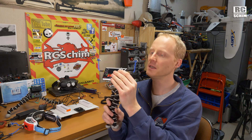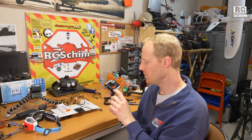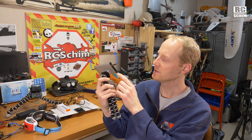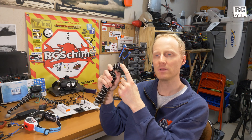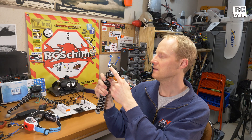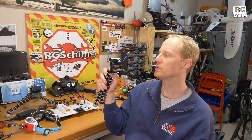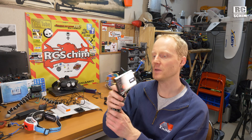Build quality is really high. It's a quite small device. It can be powered from 2 to 6S LiPos. It has this very small, like two millimeter barrel connector — it's not standard, which is a bit of a downside. And it has two AV outputs and two normal SMA antenna connectors. That's about it.